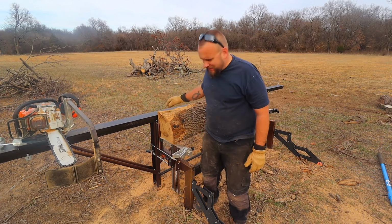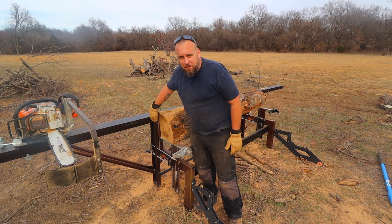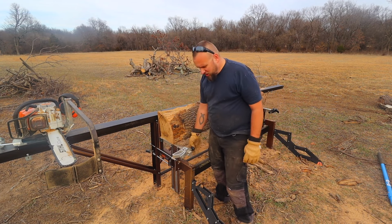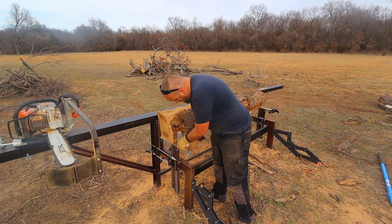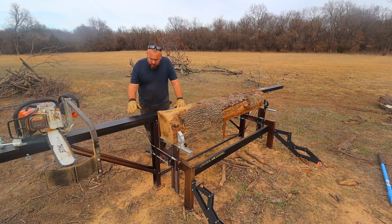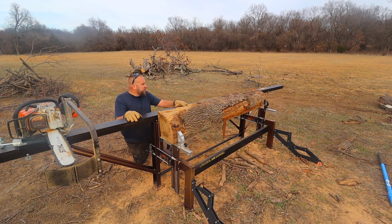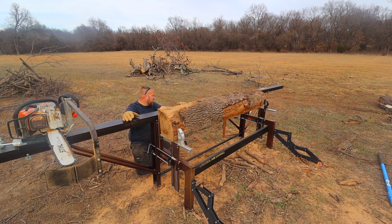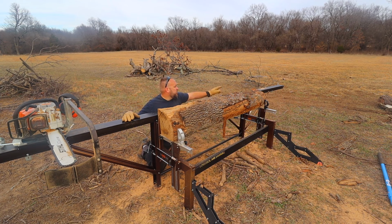This is making a nice tight 90 and a nice tight fit on these backstops, which is fantastic. That's not always easily accomplished. So let's start by going up the 4 clicks that we already went on that side, just to even the table out. All right, both sides are at 11. But with this set at 11, we're going to take almost nothing off down there. So probably going to come up an inch.